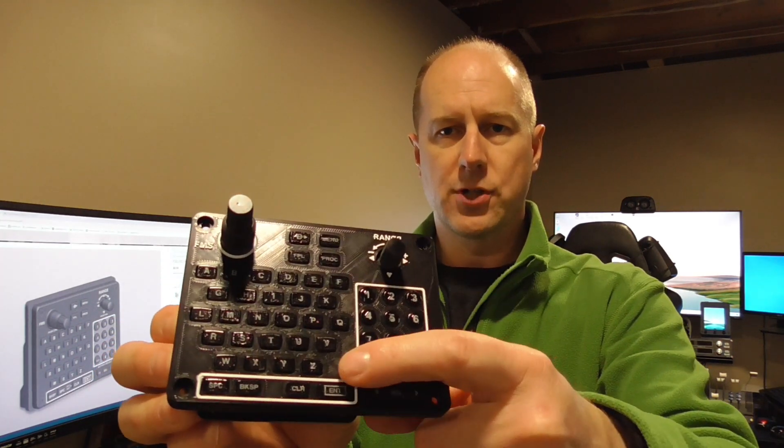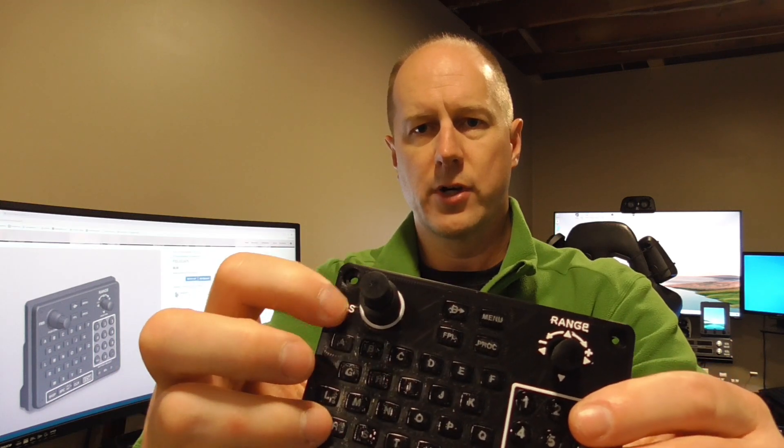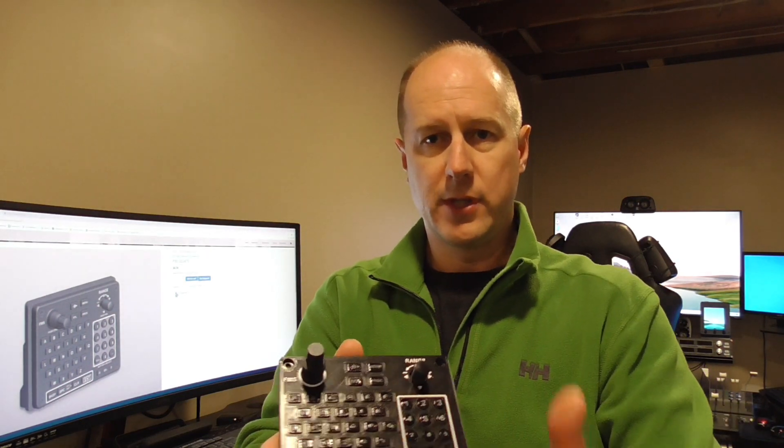Something else I didn't realize — and I haven't decided whether I'm gonna reprint this or not. The outer bezel framework I printed in black PLA and stopped with a couple layers to go and switched the filament to white to get the white around there. After I put it all together, I knew the keys were backlit, so like the G1000, the 1500, and the radio panel, I printed those in the resin printer in white, then spray painted them black, then you take a little file and sand it off so it lights from the back and you can actually see them. There is backlighting on this — around the map switch right there there is some wording, and on the FMS control there's just the letters FMS as well. If you print this in white, spray paint it black, and then sand that off, that will light up the ring around the map switch and write up the FMS wording.